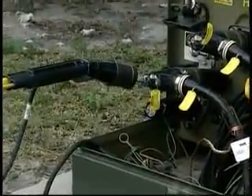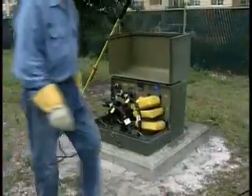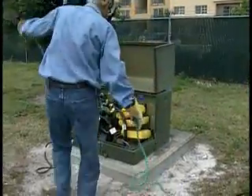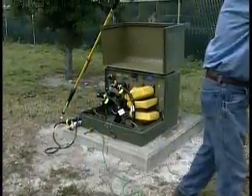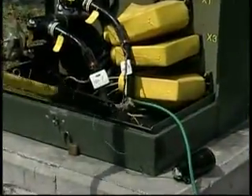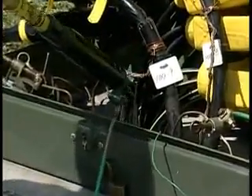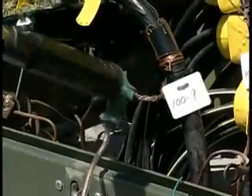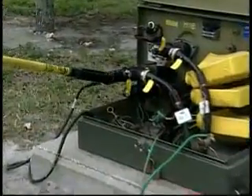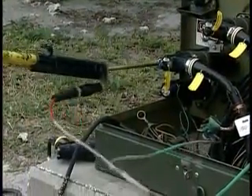After you complete the testing, be sure to insert a grounding elbow in the feed-through. You're now ready to hook up the leads from the Vaughn. Be sure the green safety case ground is uncoiled fully before beginning the hookup. Begin by attaching the green safety case ground. Then connect the high voltage return to the concentric neutral on the cable being tested, as close as possible to the cable termination point. Next, remove the grounded elbow. And finally, insert the brass elbow probe attached to the high voltage lead into the bushing.